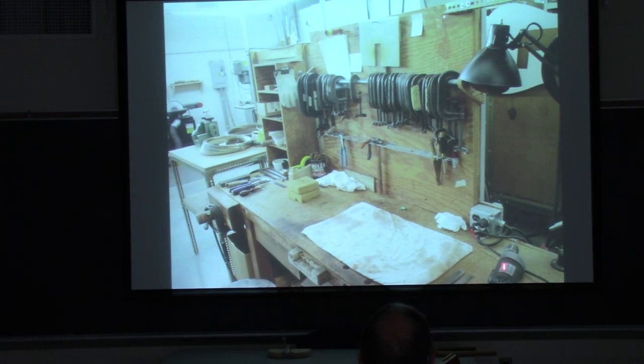Here's the drill that they use to create the drill through the fret slot. They use a massive drill bit. I don't know what size that is, but it's massive. I use about 1/8 of an inch. I use a 3/32. It's smaller than the actual width of the fret slot. 3/32 is 94. I get the next one down, so it's just underneath. It's like 70 something. It doesn't create a little half moon on the fingerboard?